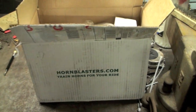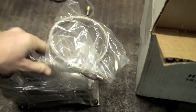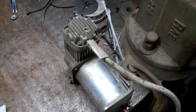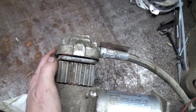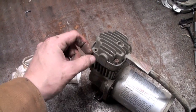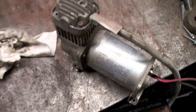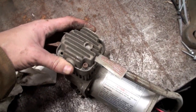I got a bit of a project to do. Got another pump here — my old pump blew up. So there's the new one; it's a little bit better than the old one. When I got the old one out, wow, I didn't expect that — the whole head is blown apart, gasket hanging out there. I already had problems with it before; the connecting rod came off the cam. I got one bolt that's full of glue like a tamper-proof system, but when I tightened it back up, one bolt broke, and looks like another bolt broke too.